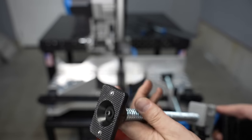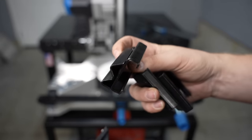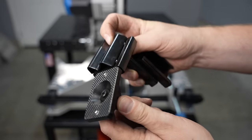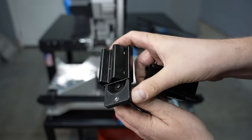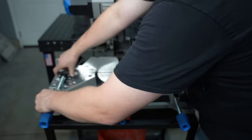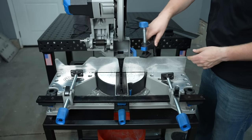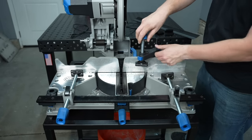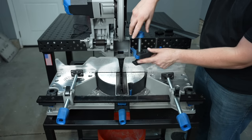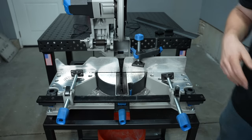This clamp bar at the front is what the clamps connect to — it's adjustable in height and the clamps slide onto the end. On the face of each clamp there are two different spring-loaded balls used to hold angle blocks in place — similar to the other saw but much smaller, so you can actually put smaller tubing at an angle than you can on the regular chop saws. There are multiple positions for the vertical clamp to slide into, and it's nice because it has a quick-acting release so you can quickly run it down to your material and tighten it up.